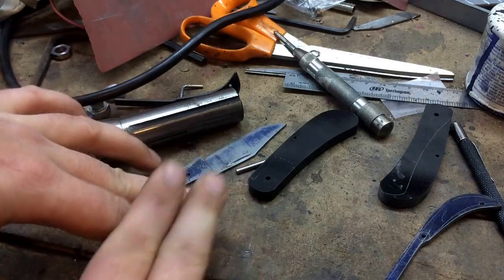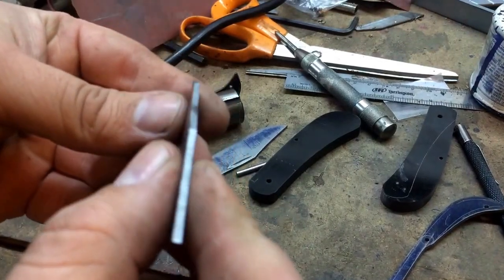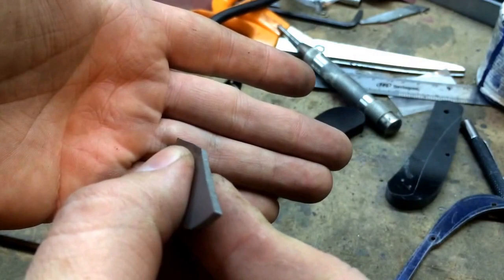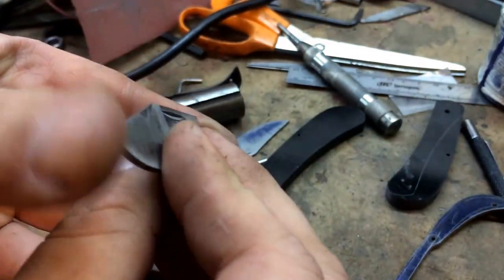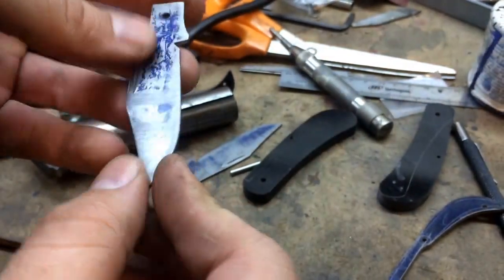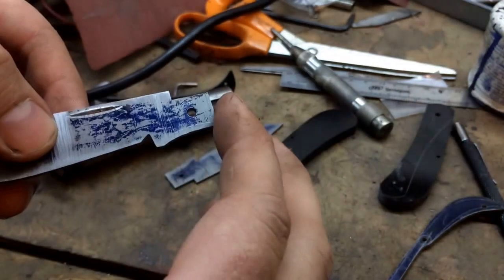Because the bit could stand to be a little sharper, it did deform just the very top of the blade, bending it out slightly. I put that down on my granite plate and tapped it with a hammer to straighten everything back in line. You can see it's still pretty flat and straight — there's a little hump there still, but that'll grind out and everything should look alright once we start finishing.